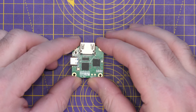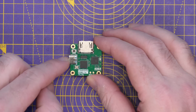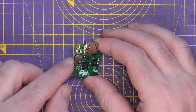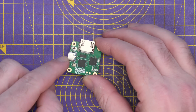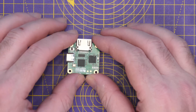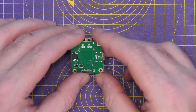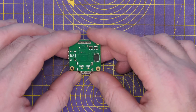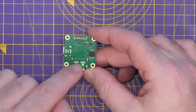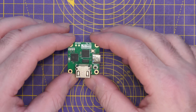Walking around this board from Cinetronics: size-wise it is 30x30mm to the PCB, or about 32x34mm to the ports. We have an HDMI input at the top, a USB-C port for connecting and updating firmware, a boot button, a ground and 5V pad, some LEDs, some chipsets, and on this side we have the standard camera connection for the DJI system as well as external one and external two pads for future functionality like forcing the aircraft to arm.